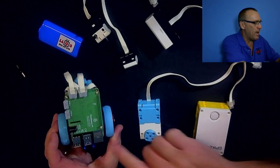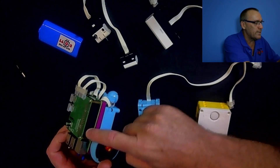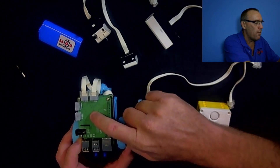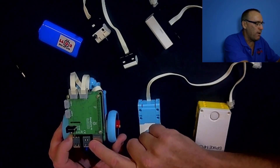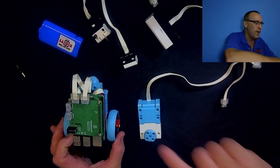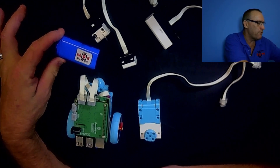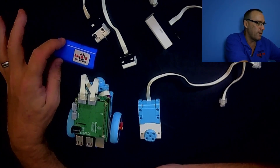I have here a Raspberry Pi 4 with the Lego HAT mounted on top using a stackable header, which allows the pins to poke through the HAT so I can still use all the Raspberry Pi features while the HAT's on it, and use these ports for all the Lego hardware. The plan is for this Raspberry Pi 4 and Lego HAT to replace the hub entirely. I'm powering it with a two-cell LiPo battery — Raspberry Pi does make an official one, but any two-cell LiPo will work.